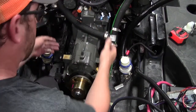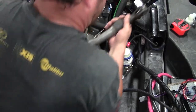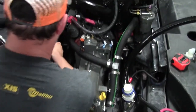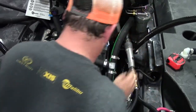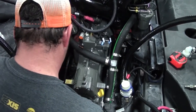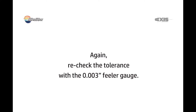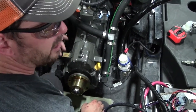Now I have tightened the pinch bolts on this engine. It has left me a gap at the 6 o'clock position. In order to close this, I am going to lower the transmission slightly. That has closed my gap at the 6 o'clock position. Once your pinch bolts are tightened and you have realigned the engine again, then you can go ahead and tighten your jam nuts, and your jam nuts will lock down the vertical movement.